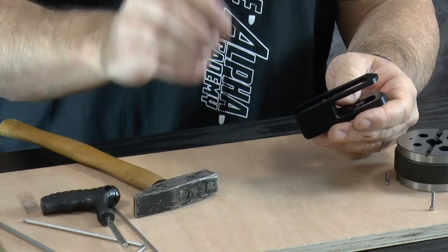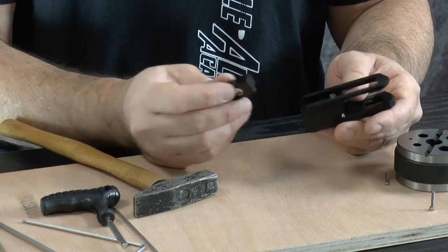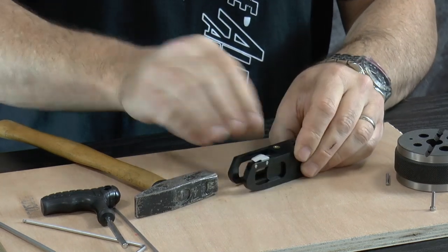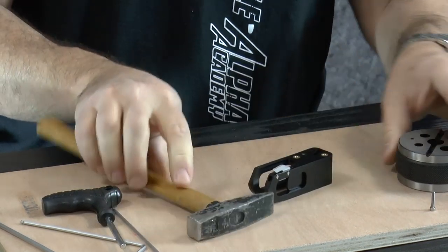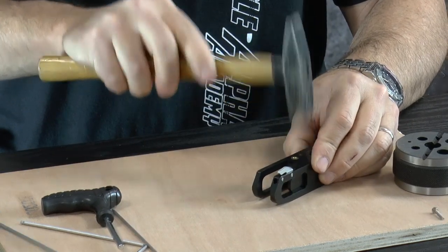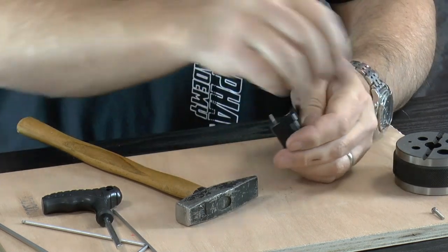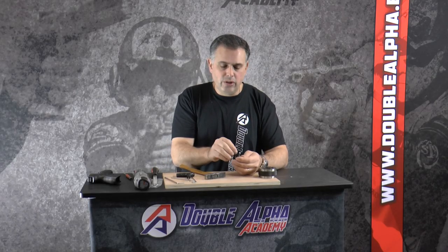At this point I'm happy with the fitting of the slide lock. I did the fitting of the block earlier and I'm ready to reassemble. Make sure your magnets are in position and in the right orientation — in this case they didn't come out of the pocket so I have no problem there. Push the wedge into place; the pins can be knocked in from the back. You only have to knock them far enough in so they're flush with the back of the holster body — if they protrude out, it will create a problem when you insert the block into the holster.